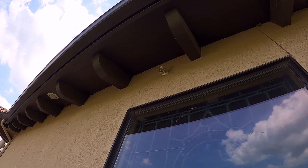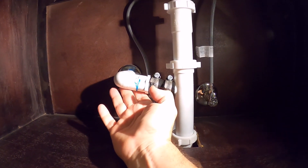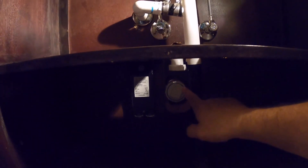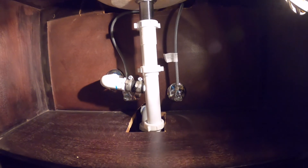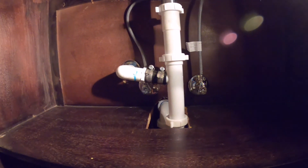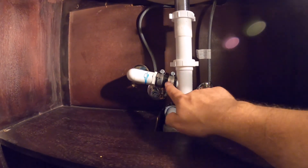I've got a feeling the main drain pipe is plugged, so we're going to go through the process to clear that pipe. What you can see here is a sink in the downstairs of the building. This line comes from a pipe that runs all the way up to the air handler in the attic, then patches into this drain pipe and goes down through the p-trap and into the septic downstream. Crud can build up in this line and cause it to back up. When your AC is running hard with a lot of condensation, without flow it'll go to your emergency overflow — something you don't want to happen.